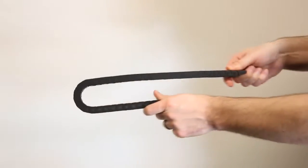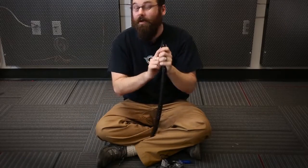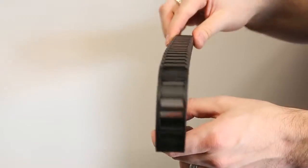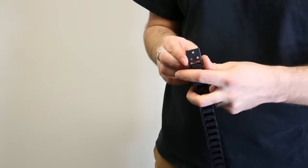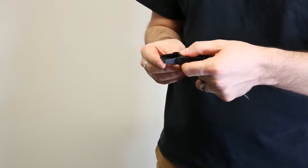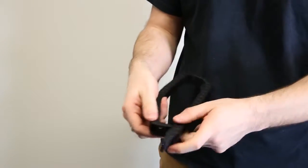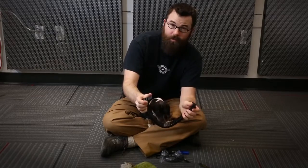The particular cable carrier that we have this week has an outer dimension of 14 millimeters tall by 20 millimeters wide, and the internal dimensions are 10 by 15 millimeters. Each one of these cable carriers has an overall length of about half a meter, and it's divided into all these different sections. They have nice little end points at each one that you can use to attach, with three mounting holes, and each one can actually be bent at an angle for different mounting options.